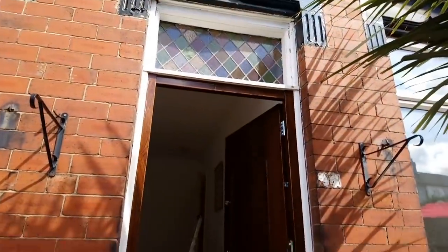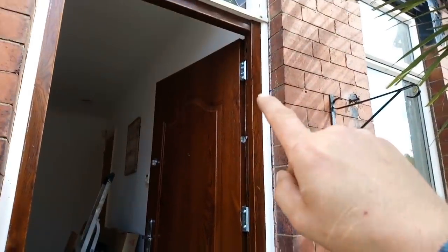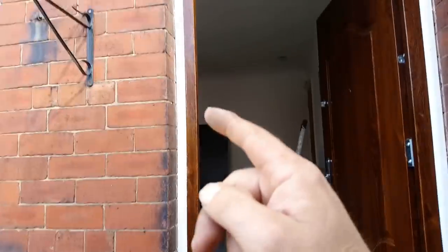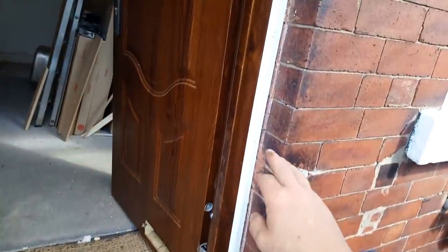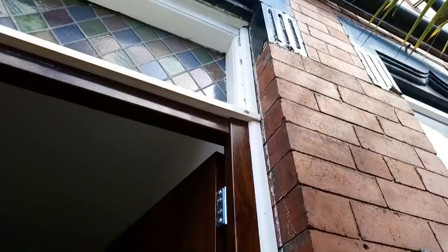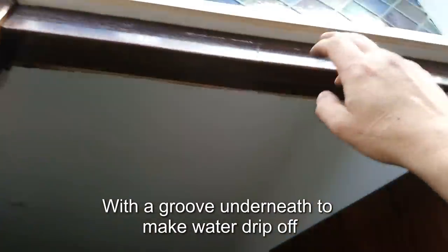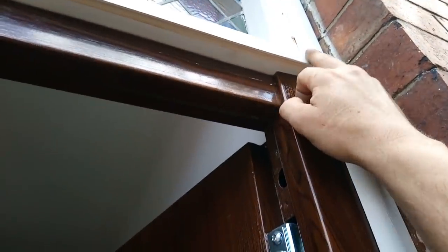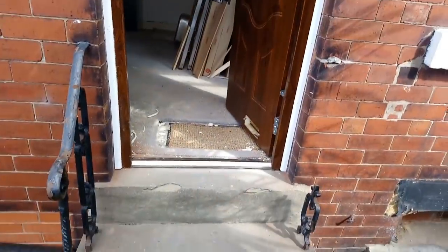Pull it up. Alright, just come back to this door. I fixed this leg on the frame, hung the door, swung it shut, then fixed this frame. I just screwed it to the wall. Now I've just put a bit of batten down this side, and that piece you saw me do on the router, that chamfer's on the top. Got a bit of filler in that screw. That's just going to get painted white.